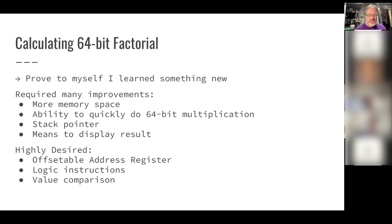I also wanted logic instructions — AND, OR, and XOR — and direct value comparison in hardware rather than relying on the implied interpretation of subtraction. And one critical addition was bit testing: being able to check the value of a specific bit within a value. When you have peripherals with status registers, individual bits often mean something specific, so being able to test an individual bit is important.